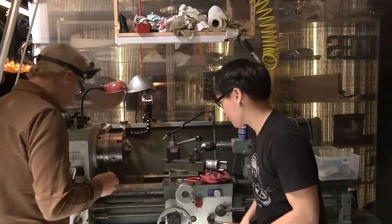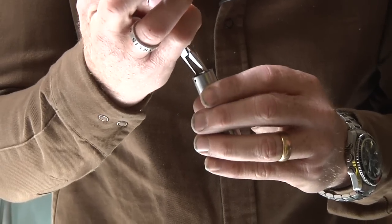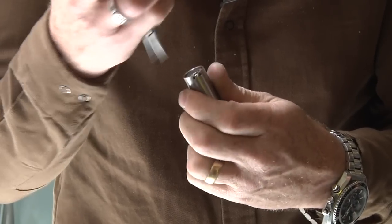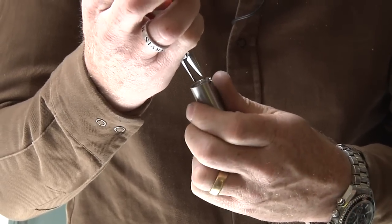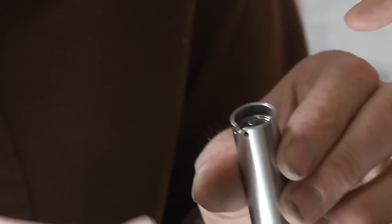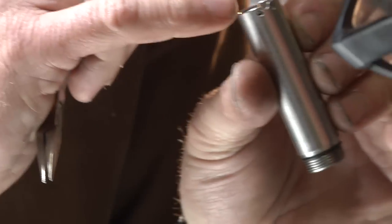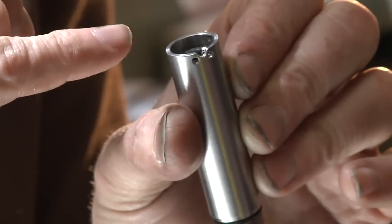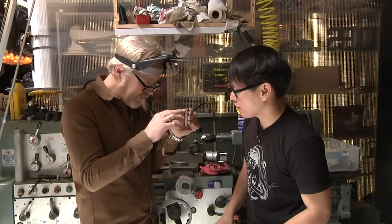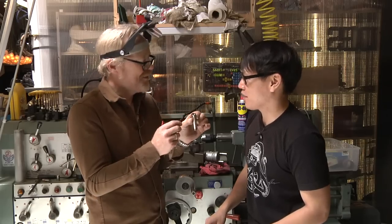Battery goes out. Now I'm going to pull the switch. I've never pulled the switch on one of these things before. When I did it before on my other one, I just did it hot because I was pressed for time, and it was kind of dumb. You don't want to break off that button. So there's the button — the actual physical button is still inside the plastic part. I've given myself room to move, deburr, and do all of that, because you can see on the side there are these two little tapped holes. I'd like to cut below those so I don't have anything sticking up. This is stainless — they don't often machine stainless. Depending on the kind of stainless, it could machine like butter or it could be a little bit problematic. It'll be fun to test it out.